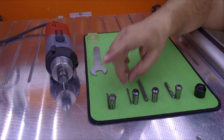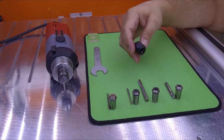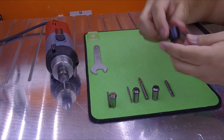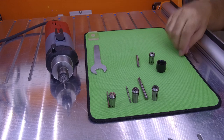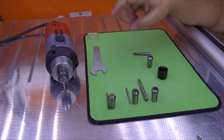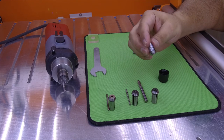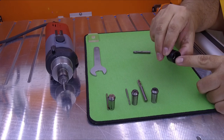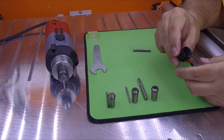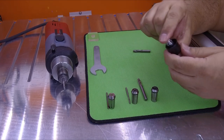The second commonly asked question is: when you have a brand new spindle nut and a brand new collet, how do you use these three parts? The correct way to insert the collet inside the spindle is to insert the collet first into the nut. The nut has a special machining inside, and it also has a rubber ring that holds the collet in place. When you put it inside, you press it and you will hear a click.